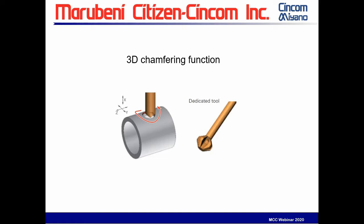Another programming function is 3D chamfering. As you know, when you put a cross hole in a part, it's very difficult to get an even chamfer around it. With this 3D chamfering, you can follow the contour of the cross hole. And even with a specialized tool, you can come in from the inside and chamfer on the inside of a cross hole, eliminating any burrs on the inside of an ID.